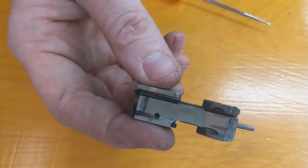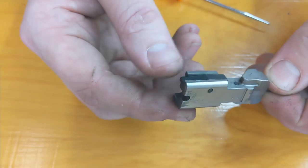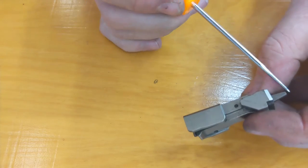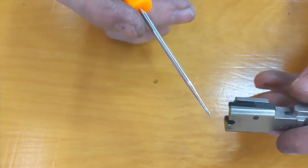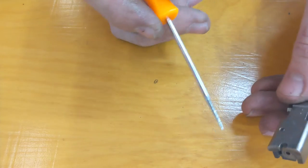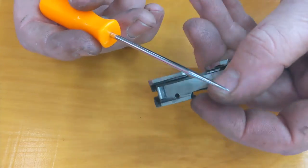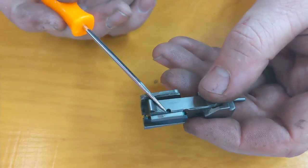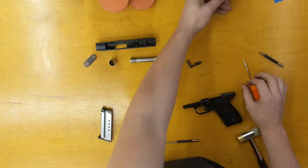You still have your firing pin, breech block. There are two pins in here that you need to take out. This pin removes the firing pin, and this pin removes the extractor. On this gun, the firing pin spring comes out from left to right and goes back in right to left. And the extractor pin comes out from the bottom to the top, and in from top to bottom.